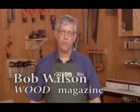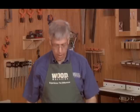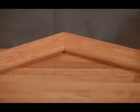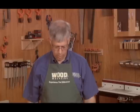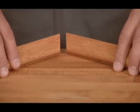When you're making your own baseboards and chair rails, you're going to have to decide what to do when you come to an inside corner. On smaller projects, you might be able to get by with a mitered joint, but with baseboards and chair rails and, to a lesser degree, door and window trim, you're going to be working with long lengths of wood. Those long pieces of wood are going to shrink and swell with humidity, and when they shrink, that inside joint is going to pull apart.